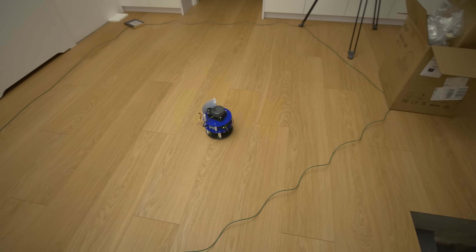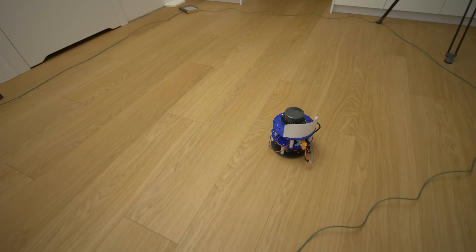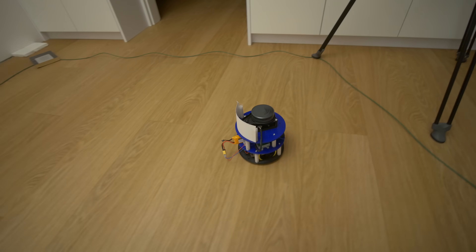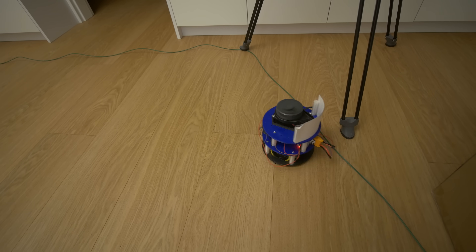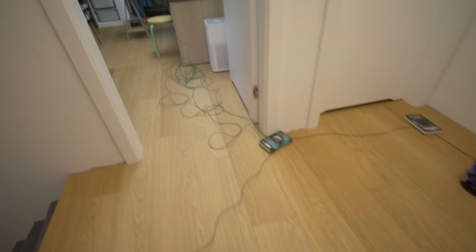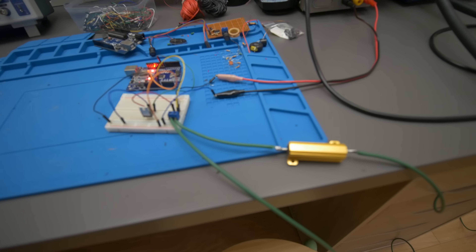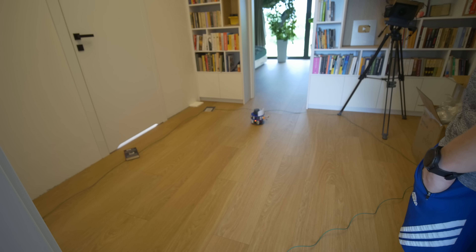But I really wanted to see it moving, so I connected the sensor — the detector circuit that I built — to one of my robots that I used when building my machine learning robot, and it totally worked. In the past I built an Arduino bass guitar tuner and used FFT (Fast Fourier Transform) to figure out the frequencies. I wanted to use the same approach to detect the perimeter wire at 5 kHz, but it turned out to be unreliable — maybe the frequency was too high and Arduino was not able to keep up. So I found a different method online and used that. I also thought about using a peak detector circuit, or envelope detector. It didn't work — we'll get to that later. And that's how pretty much every single lawn-mowing robot works.